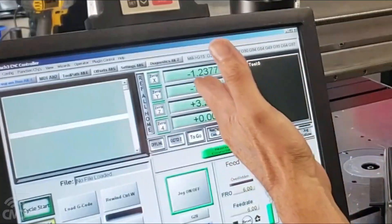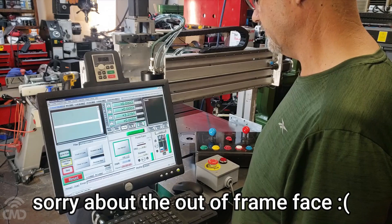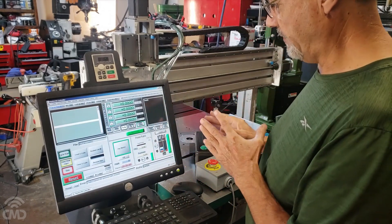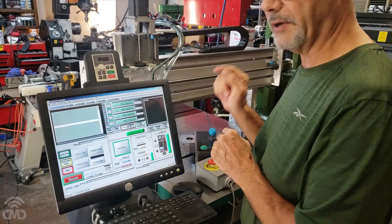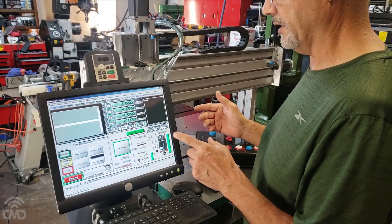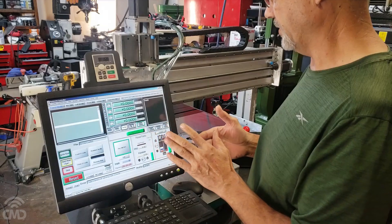Now you can see that my zero position is different, so I'm going to go to the zero position. That's the zero position — if I have a fixture and I want the tool to be right there all the time, well, when I turn it off and move it, it's not going to be right there anymore. If you home the machine and reconcile home, then you know the exact position.